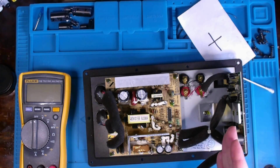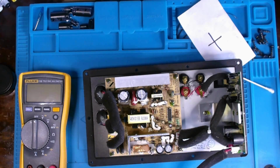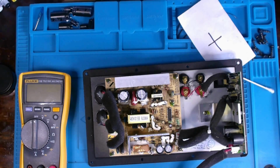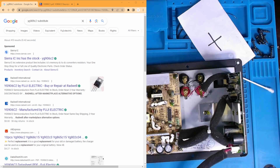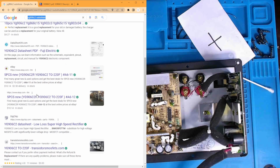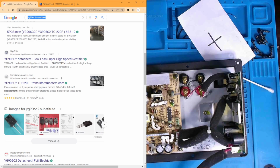And there's no sense in me troubleshooting anything else beyond this, because with no power, I can't look at anything over here. So I have to get a few of these ordered up and the capacitor replaced, because those are the obvious things that are standing out. We can attempt to power up the board from there and see what we get in return, and see if more troubleshooting and diagnostics is needed. That all being said, you should all know me well enough by now, when it comes to finding a sub component, I will do it, especially if the component is going to come internationally, by AliExpress or an eBay buy. I don't like doing those kinds of things.